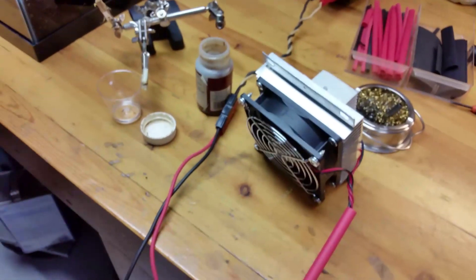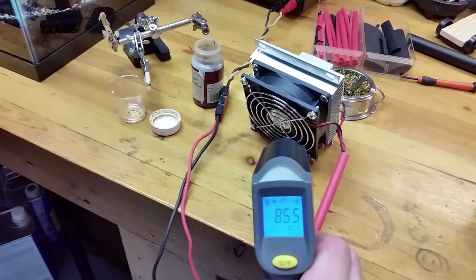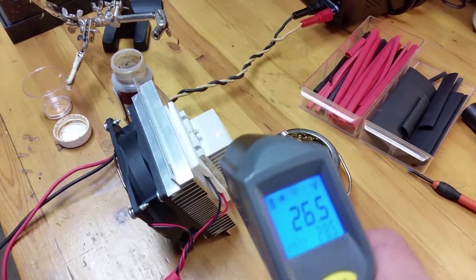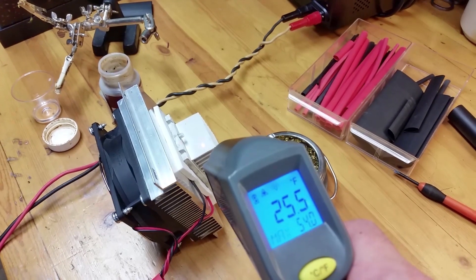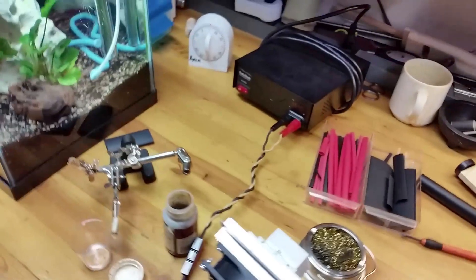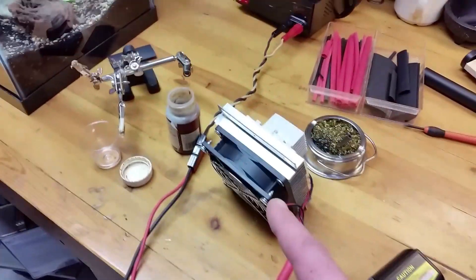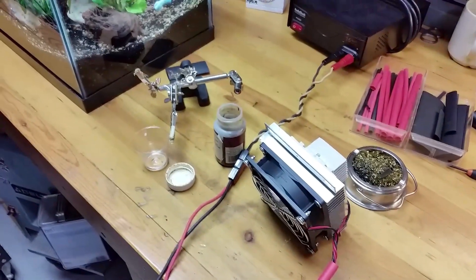Of course, you need a way to pull the heat away from the heat sink. Take a look here on the discharge side — 86 degrees. And then look at the cool side here: 25, 26, 27 Fahrenheit. It's being driven off of this 12-volt power supply here — it's a 15-amp, more than enough. I have the DC fan and the Peltier junction in parallel running off that 15-amp power supply.